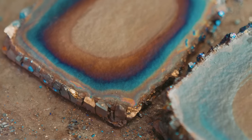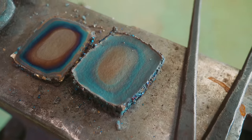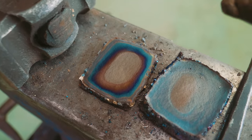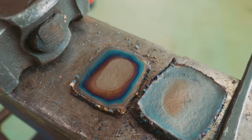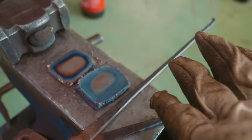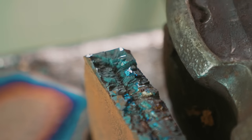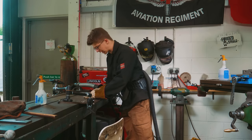Have a look at those beautiful colors on that titanium oxide surface though — just stunning. You'll see the steel is more concave and the titanium is more convex, which is interesting because the steel moves easier than the titanium at temperature. So while we were trying to hammer them together, the steel was dipping down being formed by the tougher titanium. How weird looking is that? There are some seriously vibrant blues in that titanium oxide. So back to the drawing board it is — we have our second set of pieces.